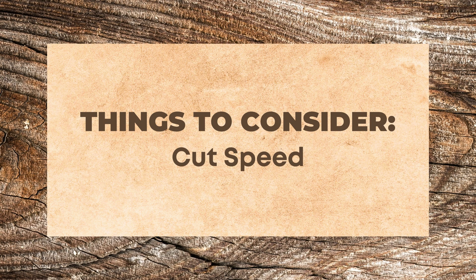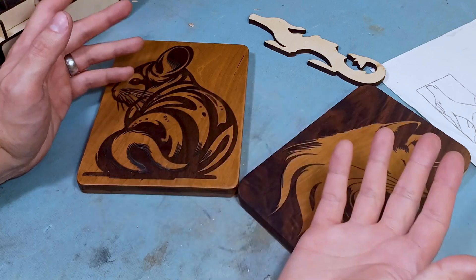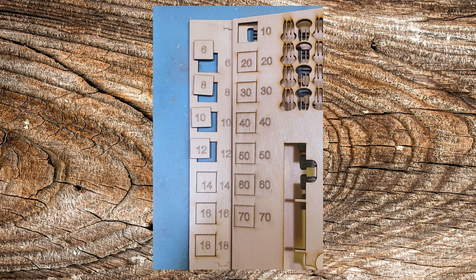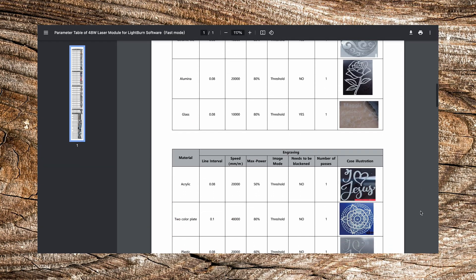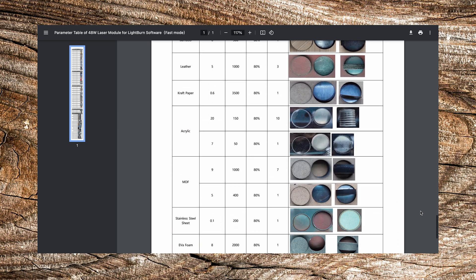Like my other videos on wood hardness, different materials and woods will require different power and speed to engrave or cut through. I recommend doing a small test at varying speeds. For cutting, I recommend using the system at its max recommended power and at its fastest speed that'll cut through the wood in one pass. Iker gives a really nice list of various materials and thicknesses with cut speeds for their specific system. You'll still absolutely need to test it on your specific wood or material first to make sure it's set properly.